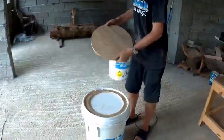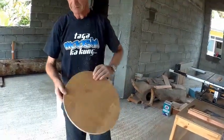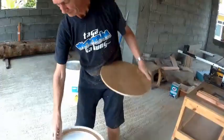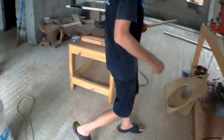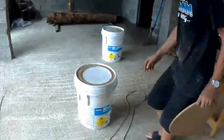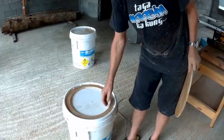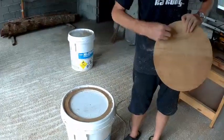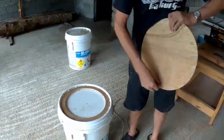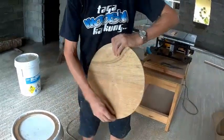This is going to be the lid, and I'm going to rebate it down halfway, and that means there'll be a lip around the side, like this. So I'll use this one first. Now the baffle, because of the thickness of whatever I'm using here, might not be the same cut as that. In any case, we're cutting on the outside. I'm going to cut a kind of rabbit, a trench around there, and then come back a bit, and then cut it all off. I'll do that by hand.